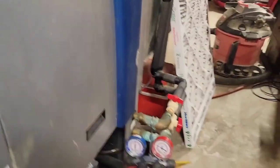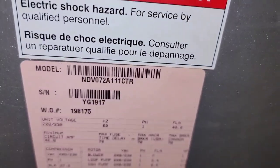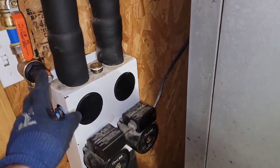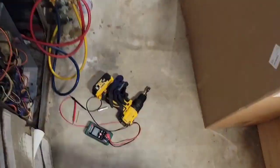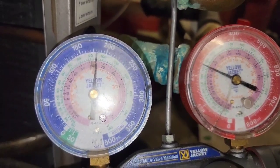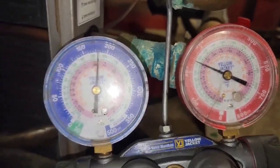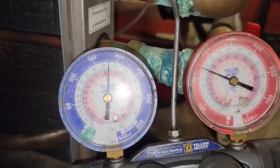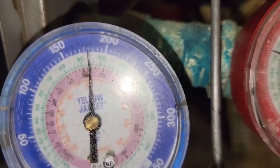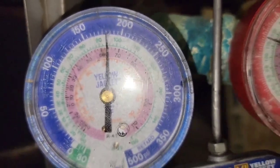This is a 72, so it's six tons. Pumps are running and pumping. We've got plenty of pressure where I put in this reducing valve. Compressor's running, but that suction is really high — super high for 410A, and it's not very hot in the house, so it should not be.